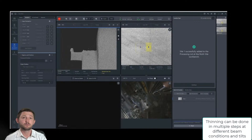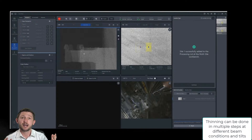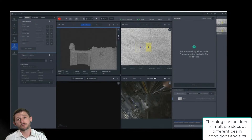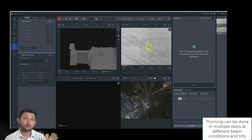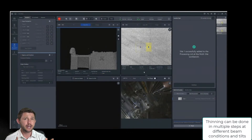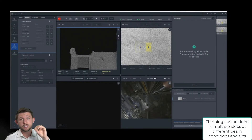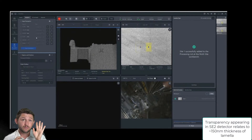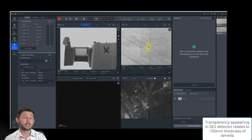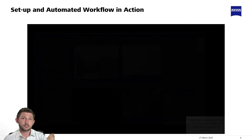The thinning process is handled by the automation. A user can specify a number of milling steps of different overtilts and different probes, and in the end you can aim for a specific thickness target. For this example, I aimed for about 150 nanometers, because this is a sample where I'd like to hit a specific feature within that thickness. We're going to talk a little bit about how you can follow up this automation with very powerful manual polishing. You saw at the end some transparency in the lamella at that acceleration voltage — about 150 nanometers in thickness.